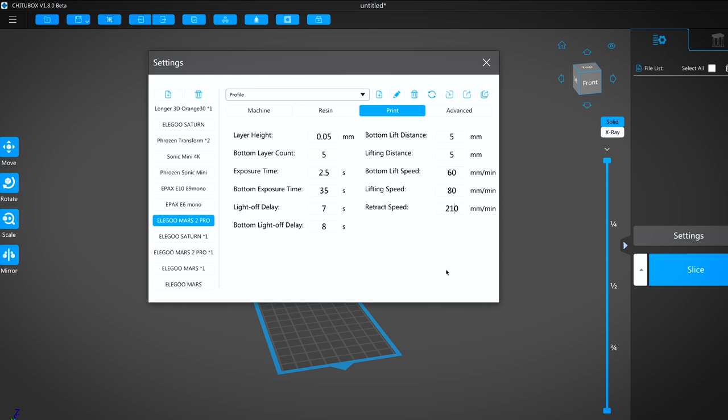So if you want to try this out for yourself, take your existing settings and bump them up to 180 and run a test print — that's exactly what I'm going to be doing here today. You can then up that even further to 240 and see how that performs. Depending on the machine and whether you need G-code or firmware changes, you'll know because you typically won't see a significant print speed improvement when increasing those settings further without those changes.